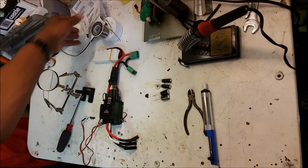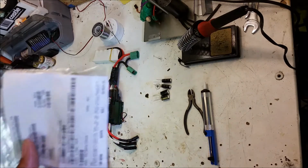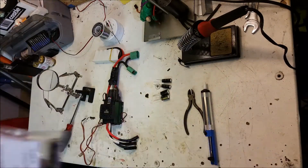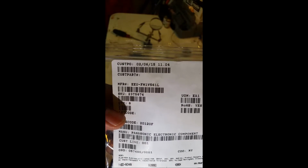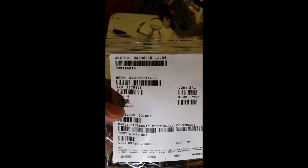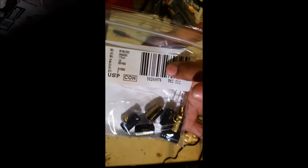All right, so a couple things. I went on the interwebs. I found a forum post. I will put a link to that forum post in the description for this video. Here are the caps I purchased. MFR EEU FM1 V561L. These are the internal caps, smaller ones, thinner. And the other one was MFR EEU FM1 V681. These are the ones that poke out of the front.